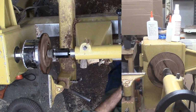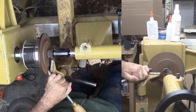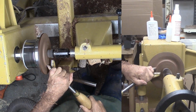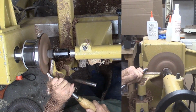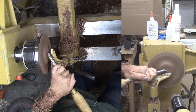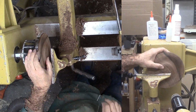Now I can flip it yet again. How many times have I flipped this box? I've lost track. I'm shaping the lid. It is a bit unusual to have a dip between the center and the rim, but that removes the void over that crack. I'm drilling a hole to receive a knob or finial, then sand and finish the top of the box.